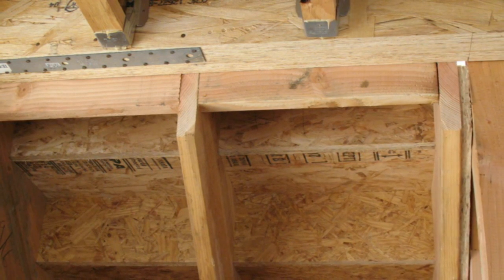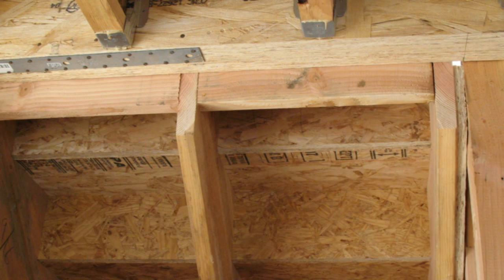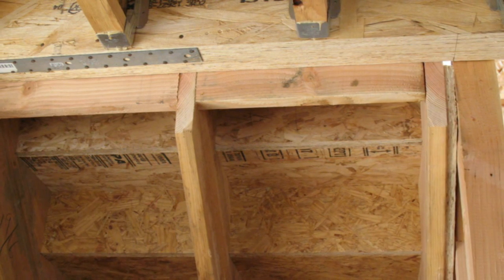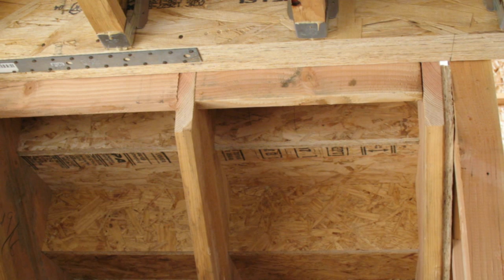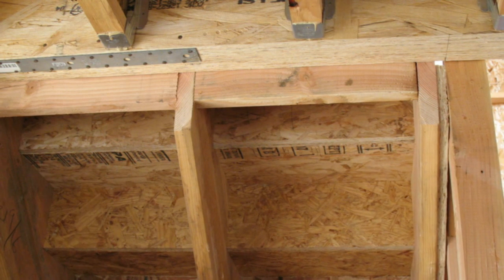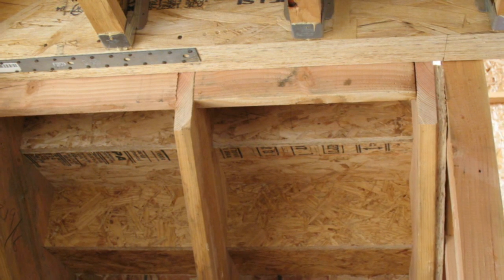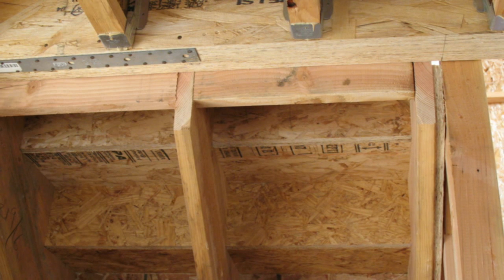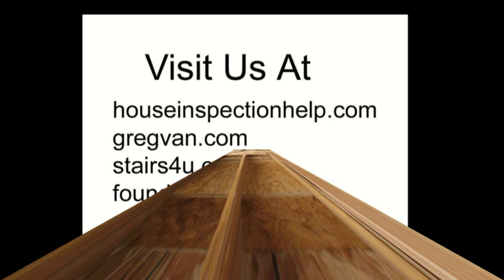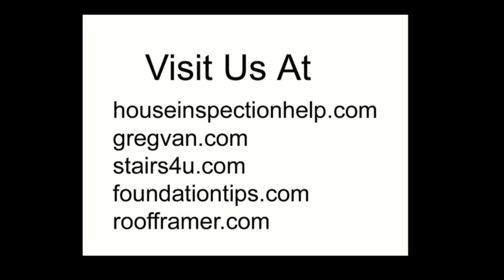If you notice, that floor beam probably can't move — it's sitting on top of a couple of walls and probably can't be relocated easily. So stair builders are going to be forced to work around situations like this and get a little creative. But again, this is not a good connection for a stair stringer at the top at all. If you're interested in other construction-related topics, we suggest that you visit a few more of our websites.